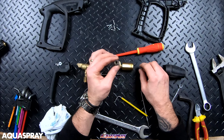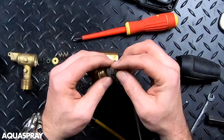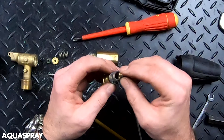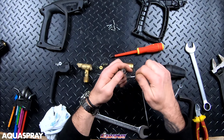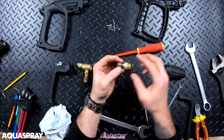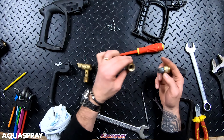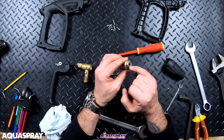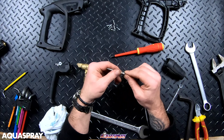Once that O-ring is in place and it's sat on top of that flat washer, just screw the grub screw in. There is a flat end where the threads are — that is the bit that goes down, so the top of the threads are at the top. Screw that on, and again it doesn't need to be tight, so just hand tighten. There's a lot of Loctite there. Make sure that this housing is nice and clear, no damage on there, no damage on this O-ring. So we can start putting that back together — and this has to be clean. If this has got damage on it, it's not going to seal properly.